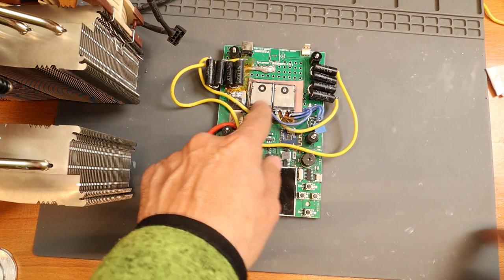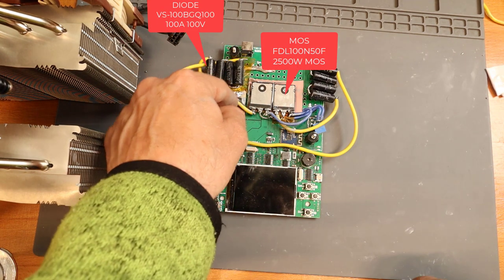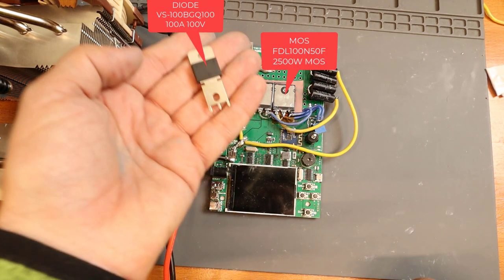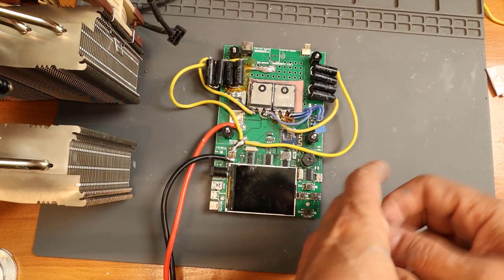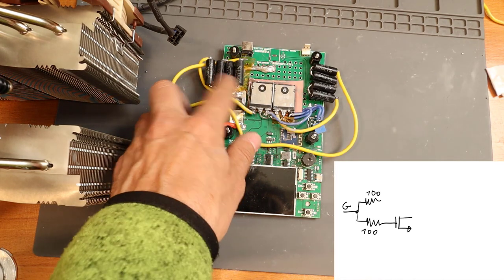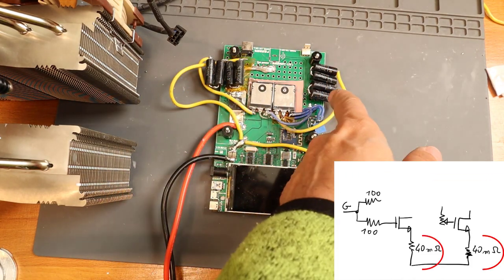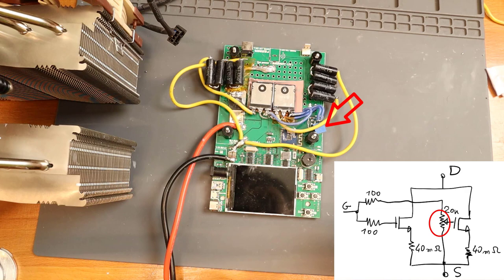This is the final result. We have the two MOSFETs, and we have also replaced the diode with a big 100A 100V diode because we are going up to 40A. Then we placed some serious resistors at the source of each MOSFET in order to equalize the current better. And then a small multi-turn trimmer to adjust the gate voltage of the two MOSFETs and to give more balance.